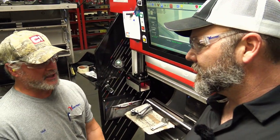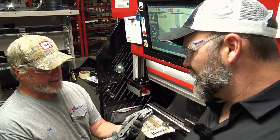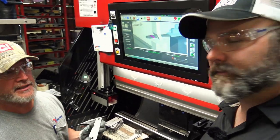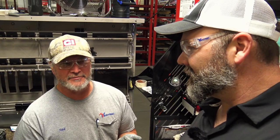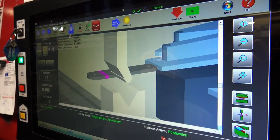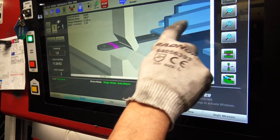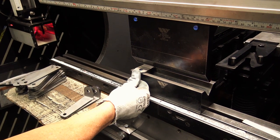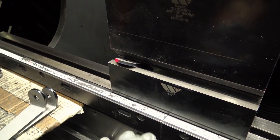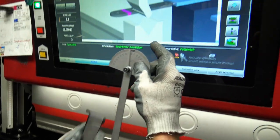We are with Odell, who's running a CNC brake press — a small 40-ton brake press. He's making a mirror bracket with one bend at 80 degrees. He's been with Ventrac about 15 years and has a son who has worked here seven or eight years. His screen graphics tell him how to put the part in to bend it — the punch, the die, the part, and the back stop. He presses the pedal to bend it, then checks the degrees with a protractor.